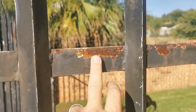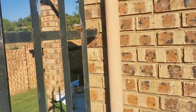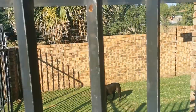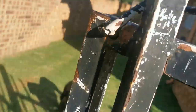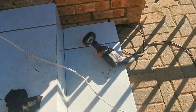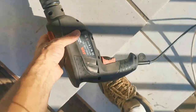As you guys can see it's really nicely rusted in some spots. So I first have to get the rust smoothed out before I put some primer or rust inhibitor on. What I'm going to do while we are waiting for Andres to finish the paving is use my drill and this lovely steel brush tip that I've put on here.